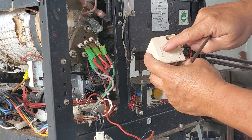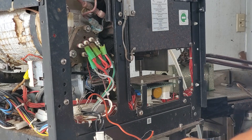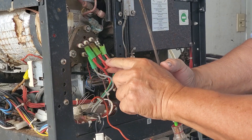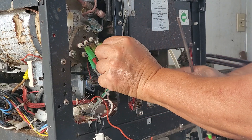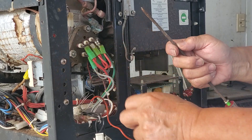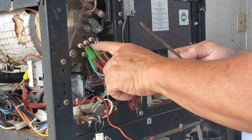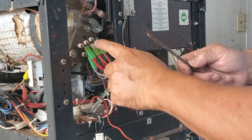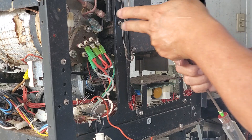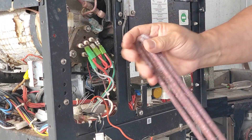The diagram even shows the letters R, S, T, U, V, W, and that's what these should be labeled as. The top ones — T3 — go to wire T3, it's marked on the wires. It's all in parallel. Generally you're looking for burns like this as an indication that the terminal is overheating. In this case it was a previous unit, so the lugs got replaced — you can see it's all shiny. There are three loops — one, two, three — so this has three elements, whereas that other one has two.